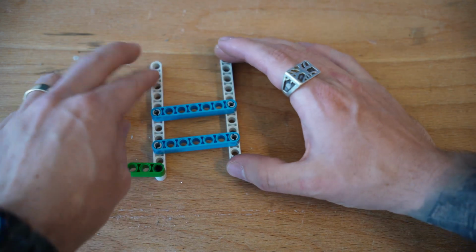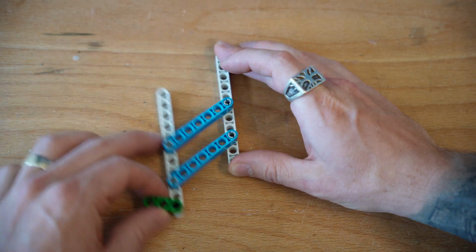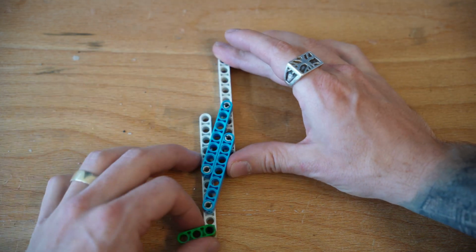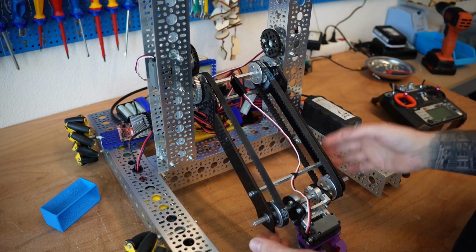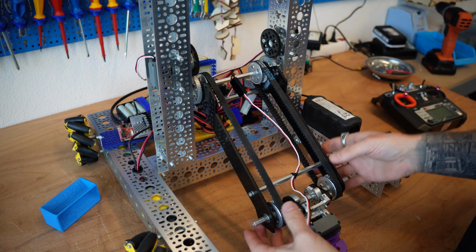Another thing about having that second arm here is you'll notice that eventually the arms will hit into each other. So it does limit your reach in how far these arms are placed apart from each other at the start and the finish of that unit. So how do you get that same parallel motion as that standard 4-bar, but making it a lot more compact and most of the time lighter?